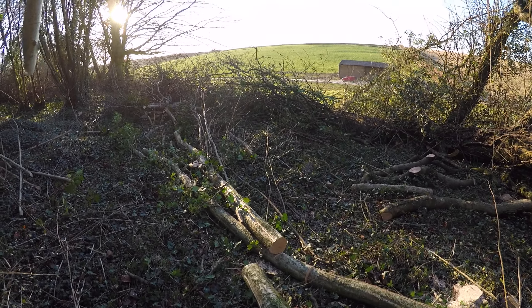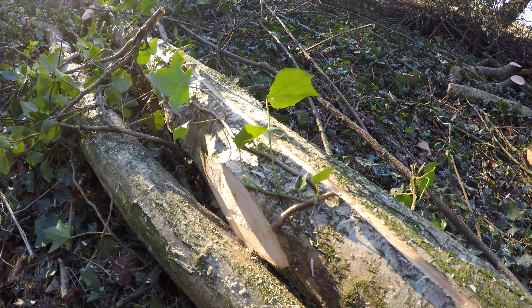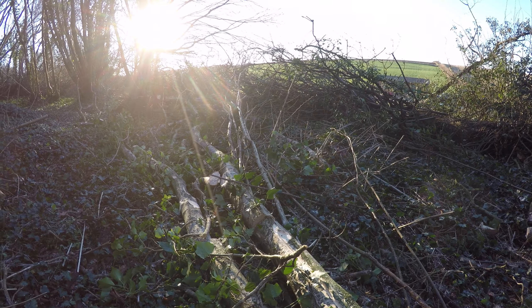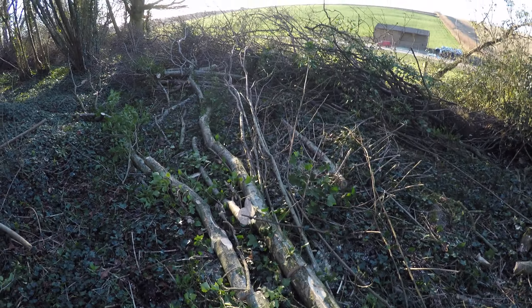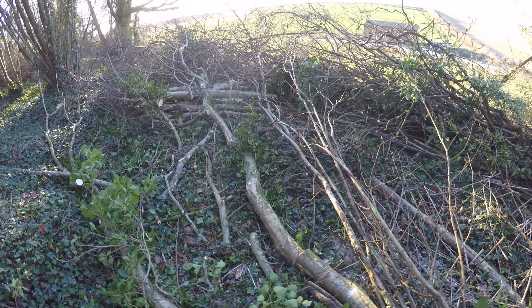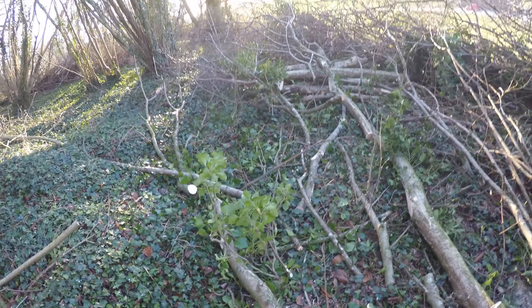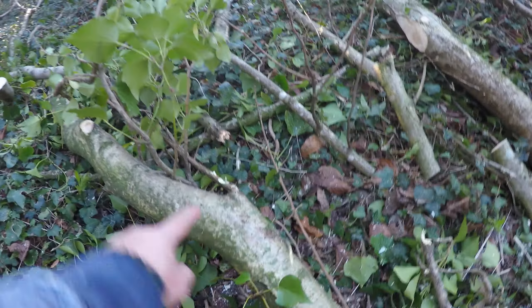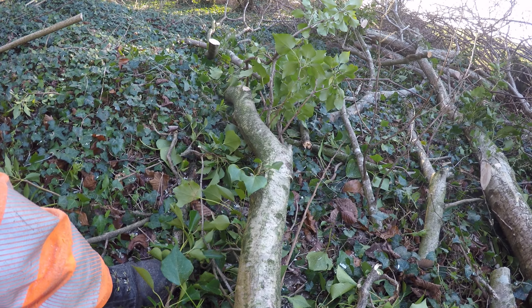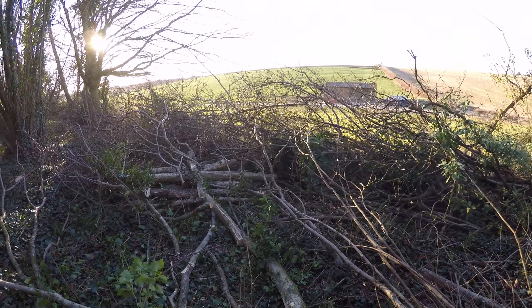Once it's down, walk up it, take off all the side branches — that's called snedding. I like to sned tight because I like a nice, neat and efficient stack on my trailer when I'm extracting, and a nice neat and efficient stack in my brake when I'm logging. An occasional wiggle doesn't matter too much, but I should have taken this off — take it off here and you can see the thing would have been straighter overall. The straighter it is, the easier it is, the better it is. A little bit of work now saves a lot of work and time later.